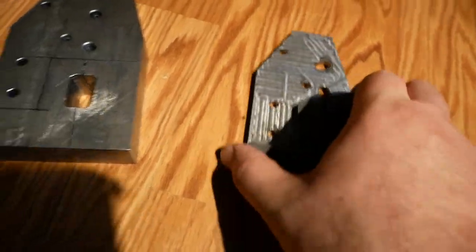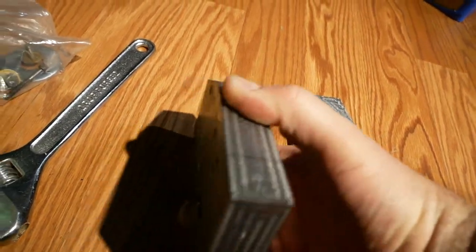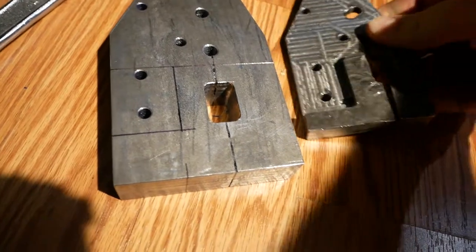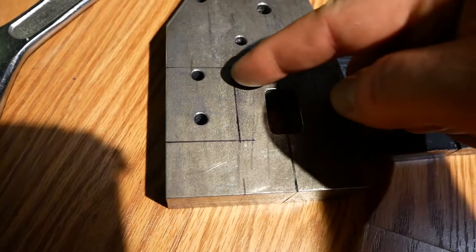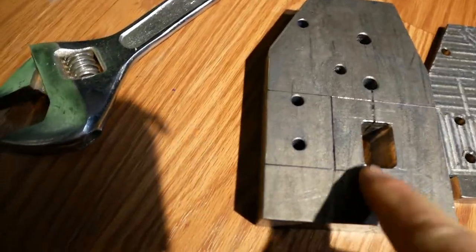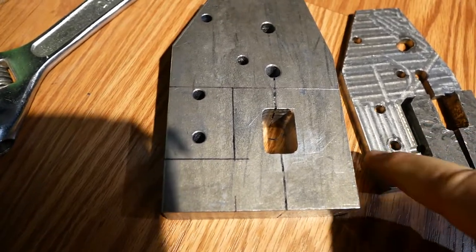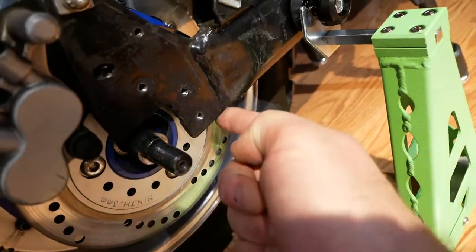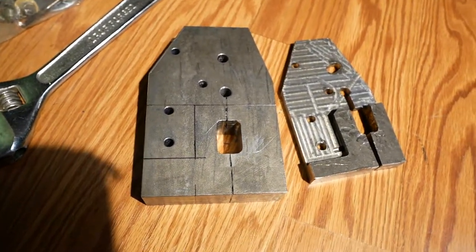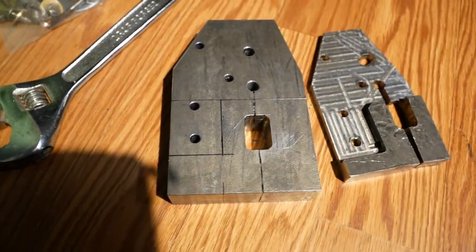So, torque arm version 4. Ta-da! This is 4140 steel again. This is the two of them super glued together — an inch thick worth of metal total, each one being a half inch thick. The only thing that's really changed is this part right here is now shifted down a half an inch, which makes it possible to put a screw through there so I can clamp that part together to hopefully arrest the spreading. Same two screws down at the bottom because that part wasn't a problem. This has also made this little piece down here a little bit thicker, but that's really a side matter. I might machine that off — it's not really necessary, it's not strengthening anything, so it can go away. It would lose a lot of weight right there.